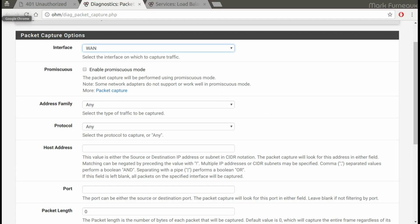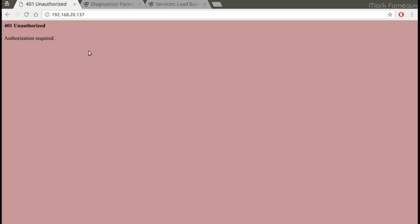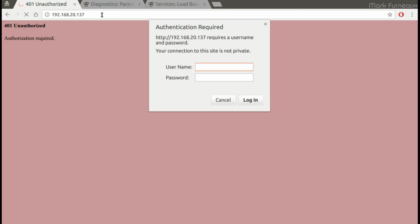And so I sent it a request, and it immediately responded with a 401 basic authentication requested. And it took me all of about 10 seconds to guess that the username and password was admin and admin. And it logs you in successfully, and it gives you a 404. So obviously there's a little embedded web server. It's the way these little wireless modules work. The wireless module does the actual HTTP handshake, and the device is just passed raw HTTP commands.